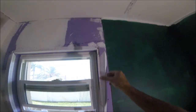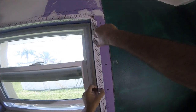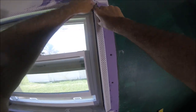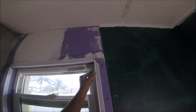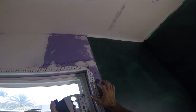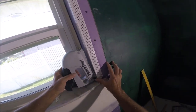The last piece — I'm going to go ahead and get the spray adhesive on it. Then just push it and kind of go down the piece of corner bead and push on it so that it's got some bite behind it. Looks good. You want it to all meet up and be plumb. Staple right there on that 45. So basically, I'm putting four staples in this corner bead, and between the spray adhesive and staples, this corner bead will be nice and strong. Now I'll go ahead and hit right on that 45 again. And all we have to do is the inside — just checking to see if that's plumb with the other corner bead. A couple more staples and we'll be ready for some mud work. And one last staple. Boom.